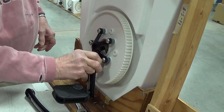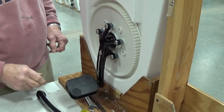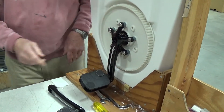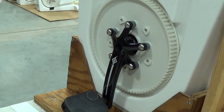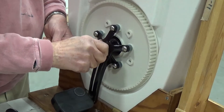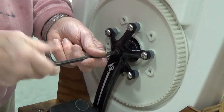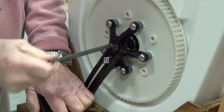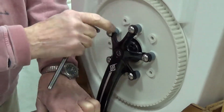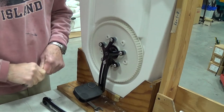So we're trying to think ahead and think of you people out in the field, and what you'll have to do later on to perform maintenance and repair on this. This slides on here and gets retained with a screw. These are also bicycle parts. This is the retainer screw — it goes in here with a 5/16ths Allen wrench and just screws on there. The four-sided axle shaft that goes through there is tapered a little bit, so this wedge holds very, very tightly and very well.